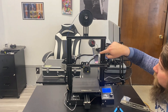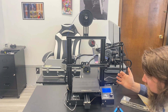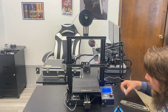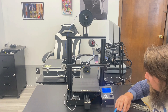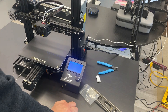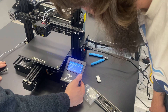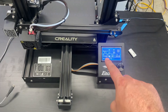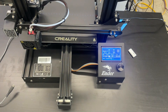We got our filament installed. It's all the way through the extruder and down to the nozzle. We powered it up and we're gonna put the default pre-made STL on there, which I believe is a dog, and I think we ought to see if it does stuff. Is there a 110/220 volt switch on that power supply? We had it set to 230 volt. It looks way better now. Hey look at that, it's doing stuff. It says the bed is heating — awesome, I think we're doing something right so far.